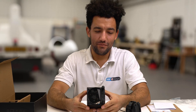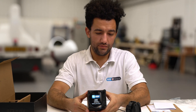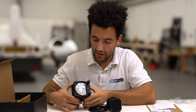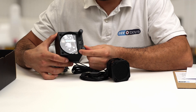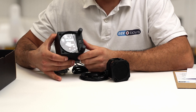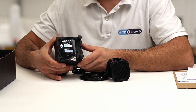Okay, time to turn it on. Using the top rotary switch we just need to press in — we're running it on its internal battery here. That's now started the boot up. As it boots up you've got the serial number and the firmware versions. Then this is where you would select the profile — this is just the default profile as it arrives from the factory. To select the profile we use the bottom rotary switch and then press in. The next page is to set the airfield elevation that you're starting at, which is really important to do properly so you've got good data to start the flight.